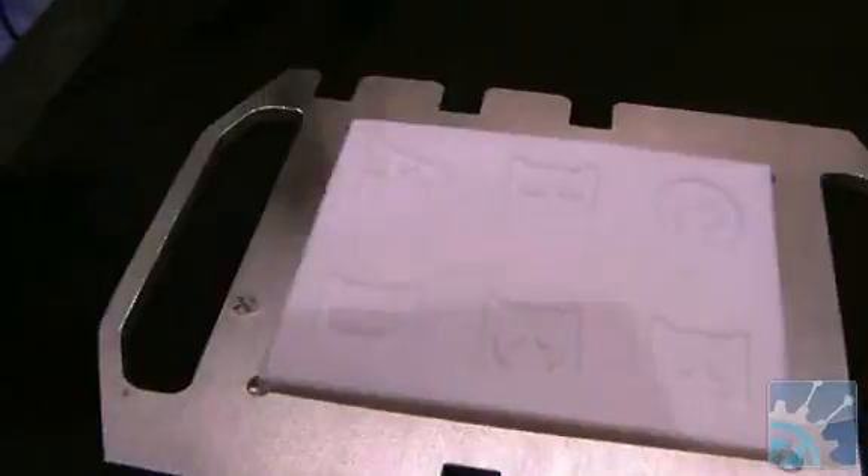After you've determined where the adhesive needs to be placed, you then expose it to the proper intensity through the UV curing lamp or through LED curing. Upon the proper exposure, the adhesive that was blue will now turn clear, or we have another adhesive that will turn pink. So the validation of the cure, without any specialized equipment, just the cost of the adhesive, will give you the validation that the adhesive, the coating, or the masking resin, or the gasket is fully cured.